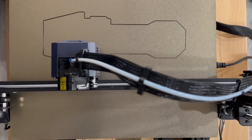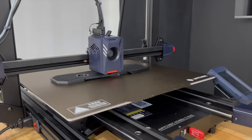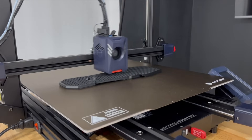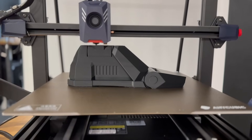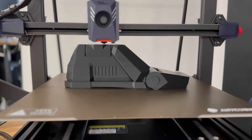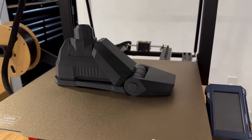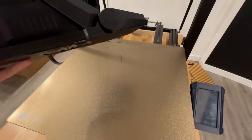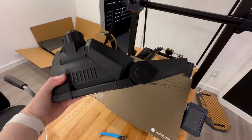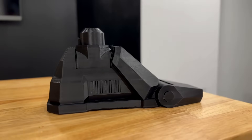The foot I did print quite hefty — I think I used like 35% infill, seven walls. I wanted the legs to have way more weight than I might typically put in a build because K2 is incredibly top heavy, so I wanted to see if I could almost counterbalance him by putting more weight in his leg pieces. But printing the feet super strong in general is never a bad idea — it has to be able to support the entire weight of the droid.